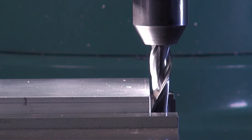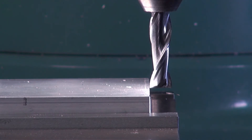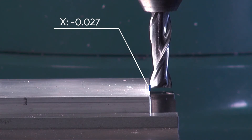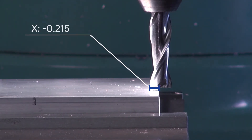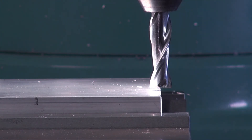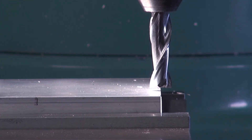But we need to consider the tool offset. The tool offset is the radius of the end mill — in our case 0.25. After raising the end mill above the part, we move in the X direction towards the part by 0.25. We can then re-zero the X axis by pressing X and absolute set. You will need to repeat this entire process to zero the Y axis.